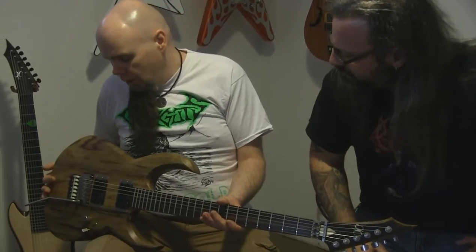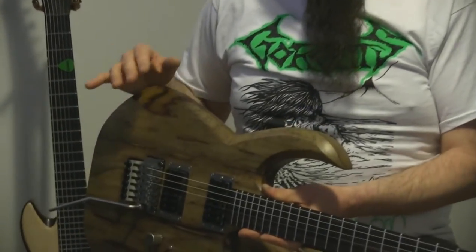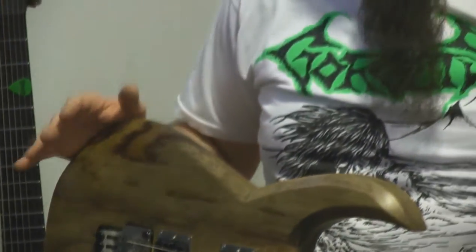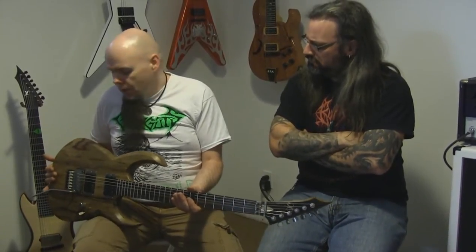Is it easy to hand-machine on the bandsaw? Not that much — there's a lot of filing to do, and you have to have special blades. The cool thing is the whole titanium tremolo weighs about the same as a Tune-o-Matic bridge. It weighs nothing in titanium — the sustain is insane. A cast steel one would weigh about two times as much, if not more.